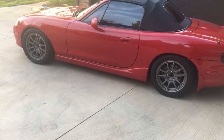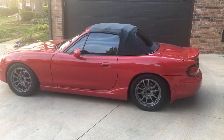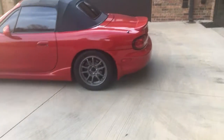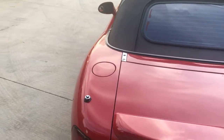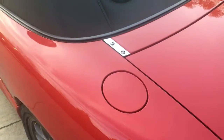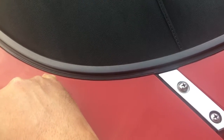This is consistent with a panel that has been repainted. That corroborates what a friend of mine who's a paint and body guy told me — he looked the car over after I bought it. The rear bumper has been painted; that's by eye, you can't measure that with the paint depth meter because it only works on metal and the bumper's plastic. The left rear quarter has also been painted. It's a very good color match, but in person you can see the left rear quarter has a smoother finish — less orange peel than the factory paint. I haven't been able to capture that in images or video, but in person if you have a good eye you can find it. There's also a very minor paint line right up underneath the edge of that trim there — kind of a tattletale.